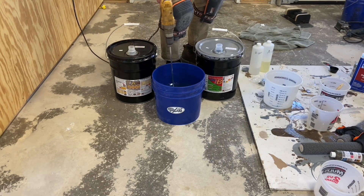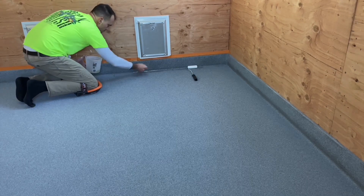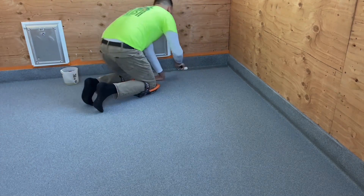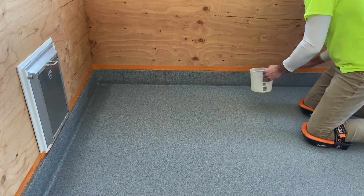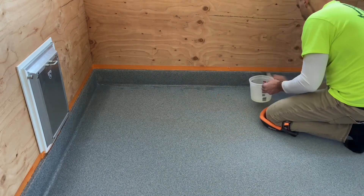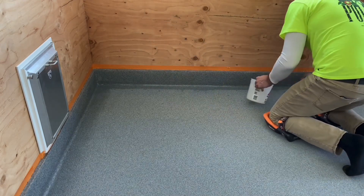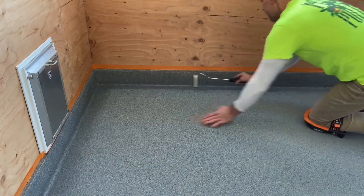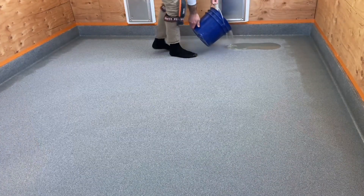Since the slab is between 47 and 50 degrees, it's well within the threshold this material requires for proper placement and curing. Coating of the quartz begins by painting the edges first — carefully cutting in the polyaspartic to the vertical edge of the quartz on the base as well as the radius, then using a small roller to carefully apply the material. Most important is to watch for excess application that can cause drips, runs, or ridges that would show through the finished coating. This amount of material should be applied carefully, preventing excess buildup along the edge.